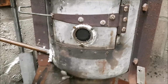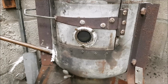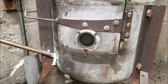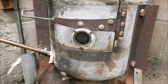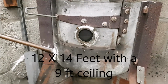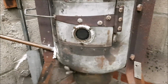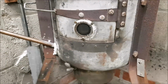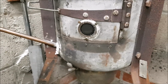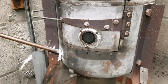If you are going to ask me any questions, if you are going to build something like this, or you are converting a stove, don't just ask me a question, because your floor space or the area you're trying to heat up is very important. I can base everything I know on the space I've got here, and to be honest, this thing would actually heat a space double the size of what I've got here, and this is about 13 by 14 inside. So if you are going to ask me questions, do a measurement of the room and the height of your ceilings. You need 3 measurements there: the length, the width and the height. Multiply them together and give us the volume of the room you're trying to heat. So just give us as much information as you can when you ask your questions, and make it easy for me to answer them correctly.